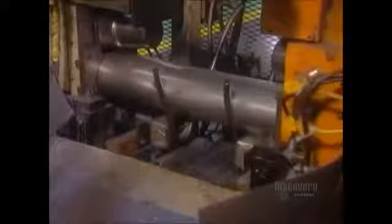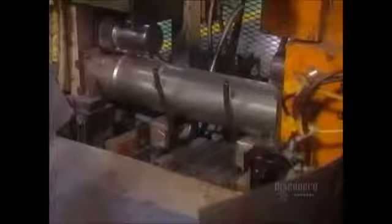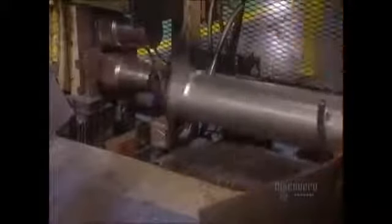Hot, moist air exits the drum through a bunch of holes and a large slot in the dryer door. The air gets channeled downward through the lint screen, then goes through a duct at the front of the dryer to the fan. The fan blows the air out this exhaust duct at the back of the dryer.